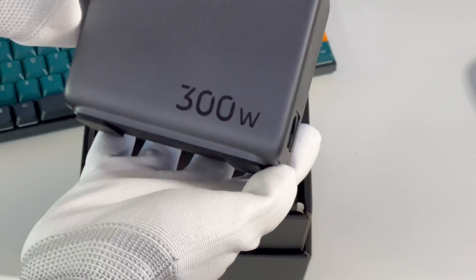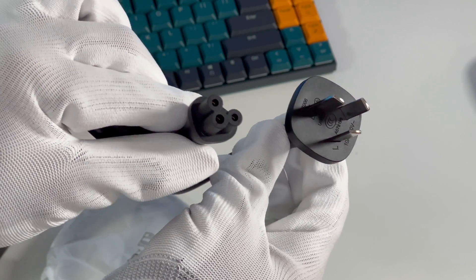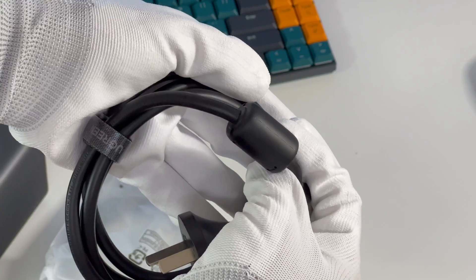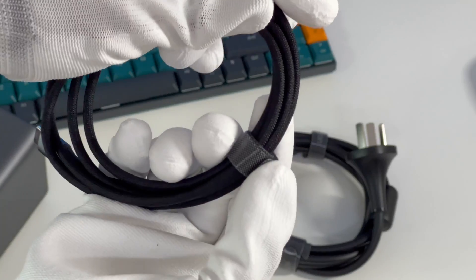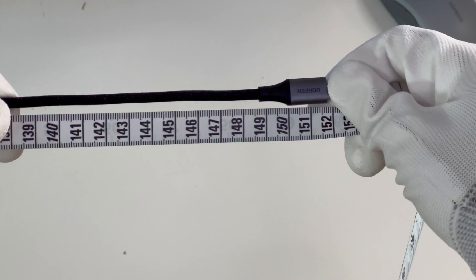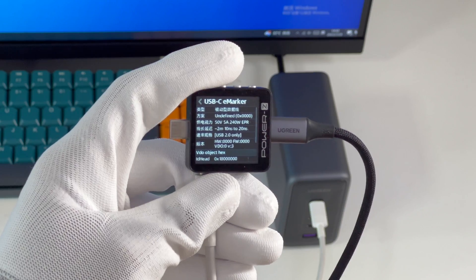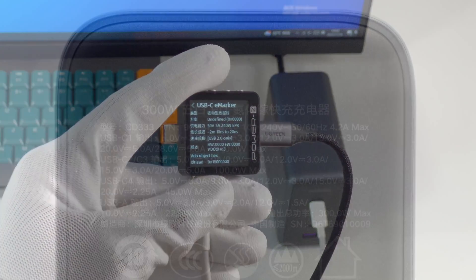Open the box, and here is the charger. In addition to the charger, an AC power cord and a dual USB-C cable are also in the box. The AC power cord adopts a three-prong design and it is thicker than an ordinary one, with a length of about 1.5m. The black dual USB-C cable features a PVC-braided design, also about 1.5m. ChargerLab power meter ZKM003C shows it is a PD3.1 USB 2.0 cable that has an e-marker chip.